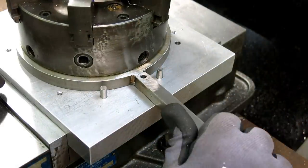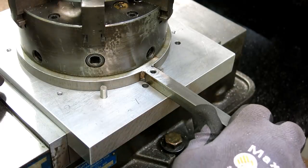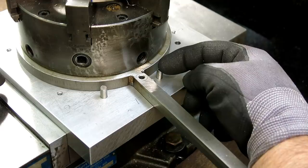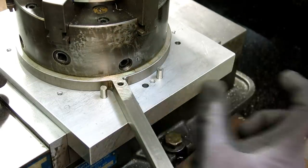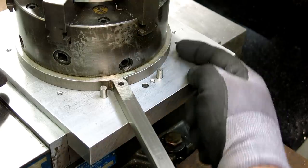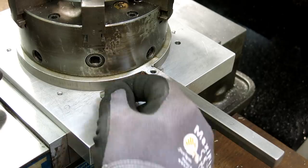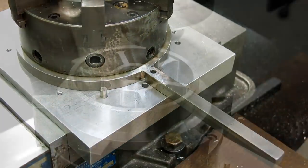Here's another shot of the stop pins. These are for the internal rotation here, and I think it's only 26 degrees of swing. And then this hole over here, we hop this pin over, and so we're trapped between two pins, and we can't over travel. That one's 40 degrees or something like that. I can't remember the number now, but anyway, that's the internal rotation, and then I can just pop these out and put them in a different spot. So that's that deal.